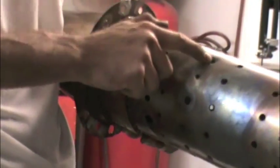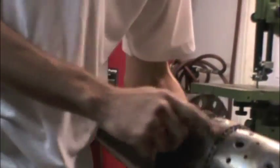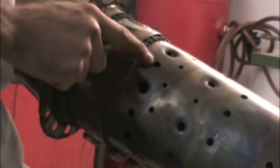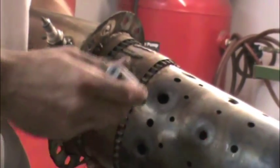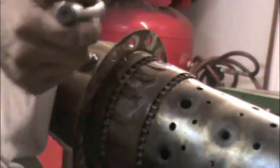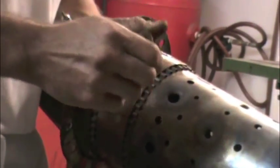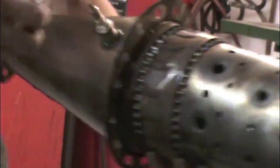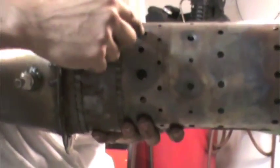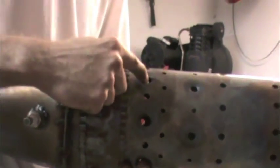This dilution area — you can see these are tapered. I tapered these holes right here using the center device from my lathe, and heated it up really red hot. It was just a standard-looking hole. I heated it up red hot, put this right on here, gave it a little tap with my hammer, took it off, heated it up again, and gave it another tap. And then you can see that it's tapered, so it's got a nice even flow as the air comes in — it flows very smoothly inside that hole.